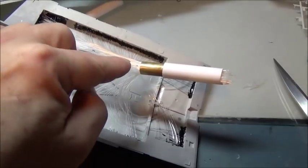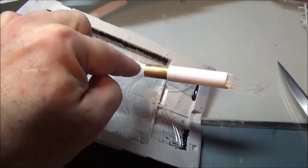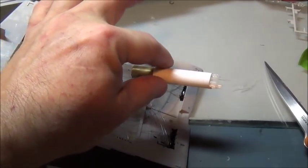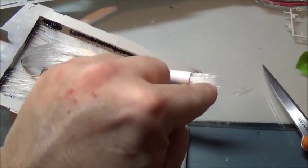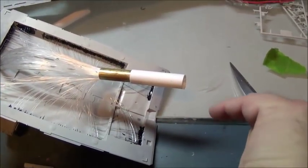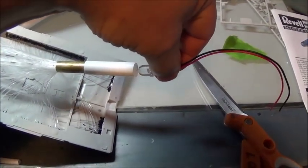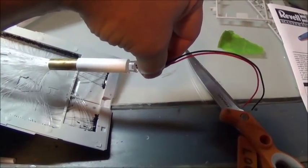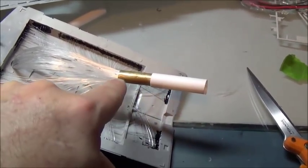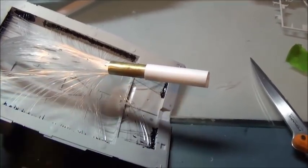What I'd like to do is to glue with epoxy, clear epoxy, gang all of this together inside the brass tube. And then once that's done, I will chop these off flat, slide this over it, pour more epoxy down into it from that side, and then stick the 10 mil LED, which is designed to be the same size as this plastic tube, down into the end of that, thereby making one solid shaft of epoxied together fiber with a bulb stuck in the end of it.